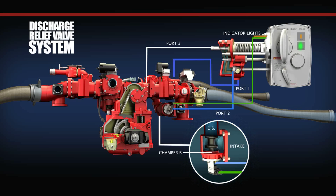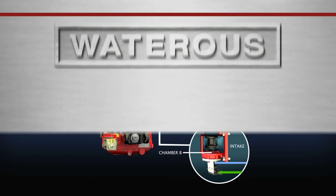At the same time, water leaves the discharge manifold of the centrifugal fire pump to the face of the main valve within the discharge relief valve assembly. At this point, the water pressure at both ends of the main valve is equal. Since the valve diameter is greater at the backside of the main valve, the total force applied is greater than that found at the face of the main valve. Therefore, the valve remains closed.